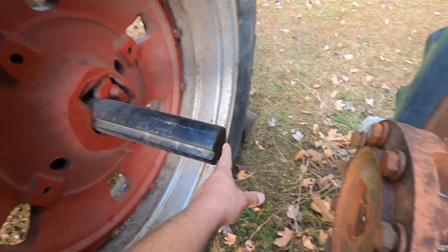On the 1066, here's your throttle right above the steering wheel. A lot of the differences I can see between this and the 1086 are the throttle handle, the TA handle, and the gear shift levers — on the 66, 06, and 56 series, they're all on the side of the hood by the steering wheel. On the 66 series, these are a lot stouter — that's a solid hunk of metal. The 1086 has stamped steel levers and when I get in that tractor I'll show you they're pretty flimsy.